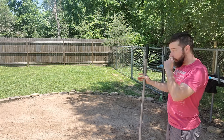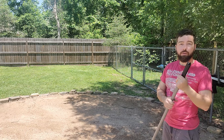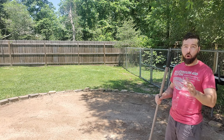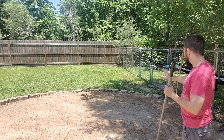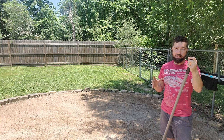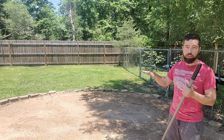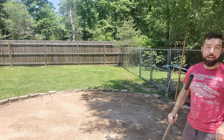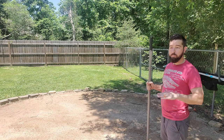As you can see right here behind me, I already have a pretty good foundation laid. To give you an example of what I've had to do personally — my home has a grade, basically a slope in the yard so that water runs away from the house. Most homes are going to have this issue. What I've had to do is on the high side take dirt out and on the low side put dirt down. I've had to build a small retaining wall, as you can see behind me, to make sure that the dirt stays in place. Those retaining walls are staked so they don't move because there's a ton of pressure on top of this soil. Let me give you a quick rundown of what I do to ensure that my foundation is as level, compacted, and flat as possible before I put on my foam.